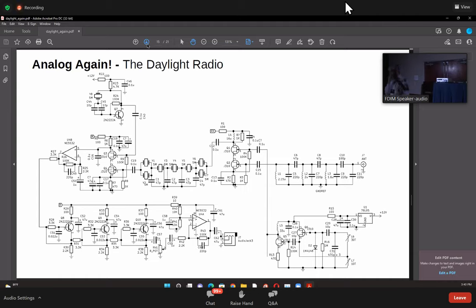I'm going to show you the picture of this. It just vanishes away, and because that vanishes away, the local oscillator is not there. Even as a transmit mixer, you do not get the local oscillator breakthrough into the pass band. Because that's not coming through, your IMD actually comes down, although this overloads very easily. The input intercept point of this is just about minus 10 dBm, which is about 15 to 25 dB less than that of a diode mixer. It doesn't matter. All you're looking for is that your distortion products should be about 30 dB below your signal.